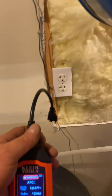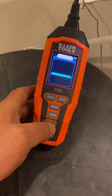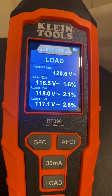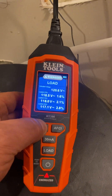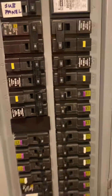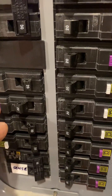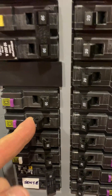Let's check a ground fault. This is a short circuit test for my new downstairs laundry — let's give it a ground fault. It tripped in 53 milliseconds at 8 milliamps. The breaker is tripped. It should be instantaneous on a ground fault, and the breaker confirms that was a ground fault. Sweet.